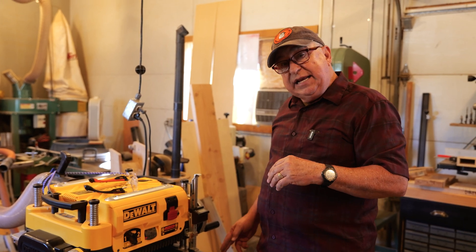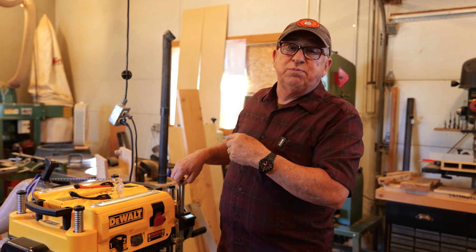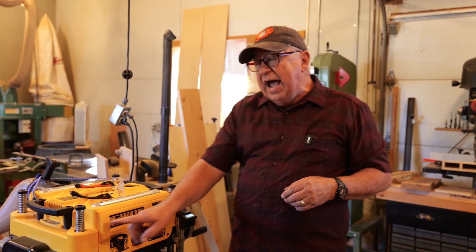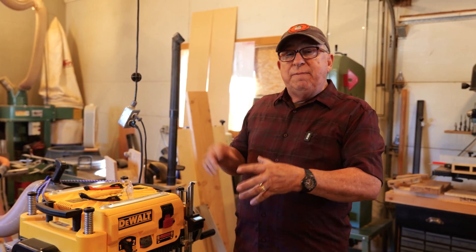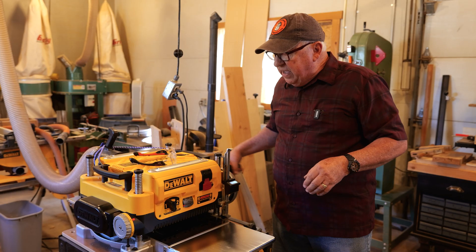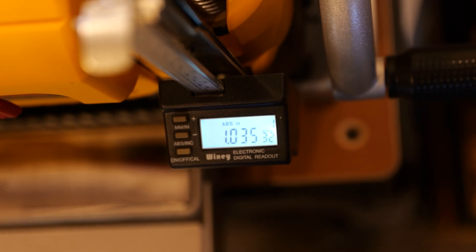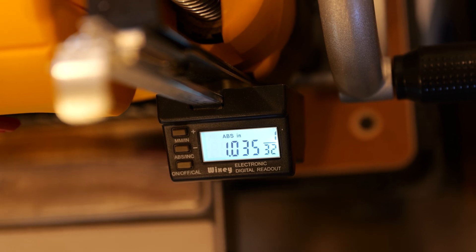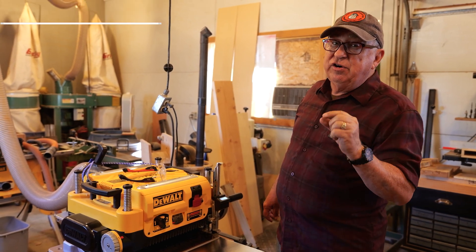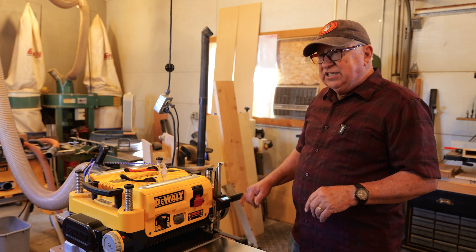Whether it's a visual sight-reading gauge or a digital gauge like the Wixie — and if you want to see how to calibrate and install the Wixie, look for those links in the description below. Once we've got these two talking to each other, we need to make sure this is lined up. When we cranked it down to the one-inch thickness setting and bumped it, the Wixie digital readout told us we're actually producing stock a little bit thicker — showing 1.03, which is one inch and a thirty-second. So this needs to be adjusted so that when we bring it down and bump against it, both readings say 1 and everything is ready to go.